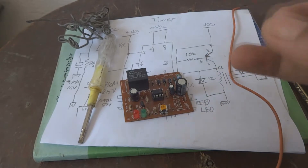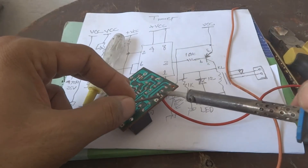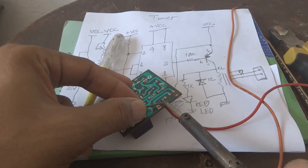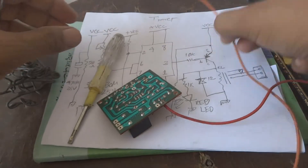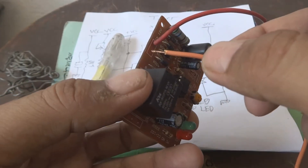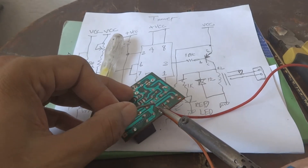I will show you step by step. First I am going to solder the first wire to the power terminals, then the second wire. For the power supply connections we can give AC or DC power — polarity is not sensitive because there is a bridge rectifier and a smoothing capacitor in the circuit.